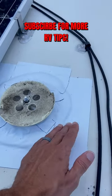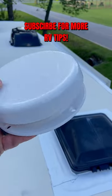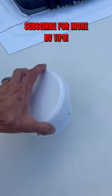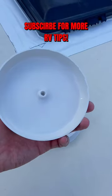Those vent holes are to keep the humidity and moisture down inside your attic and to allow airflow. Now here's a brand new one right here — the good deal is all I need is the lid to this. I don't need to install the entire base; my base is still good. I can just clean up the base, take the new lid, and screw it right down on top.